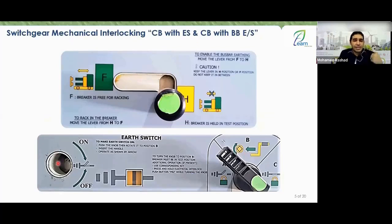And to close the breaker, what did it say? It said to turn it with the switch disc, turn it clockwise. And to open it, you turn it counterclockwise. Here you have the ground. Is it open in this position or closed when it's drawn horizontally like this? All right. When you set it to the B position, you insert the handle to close or open.